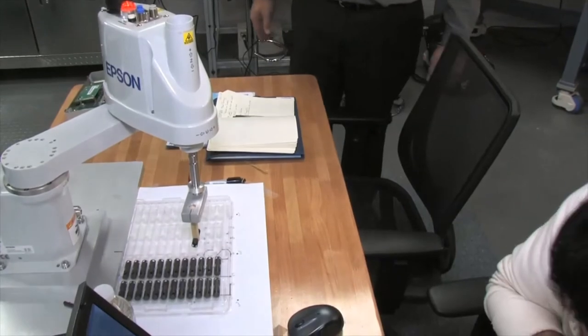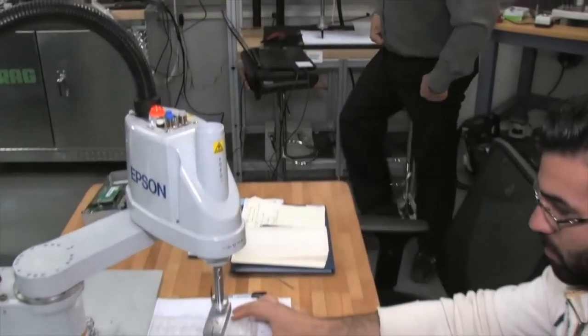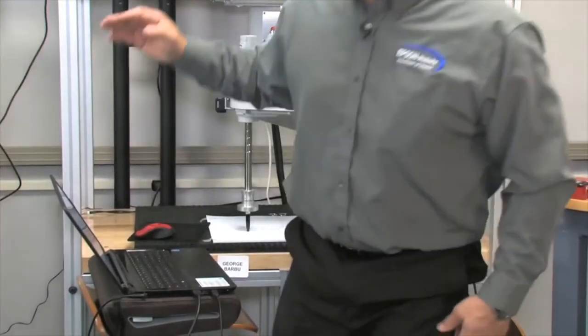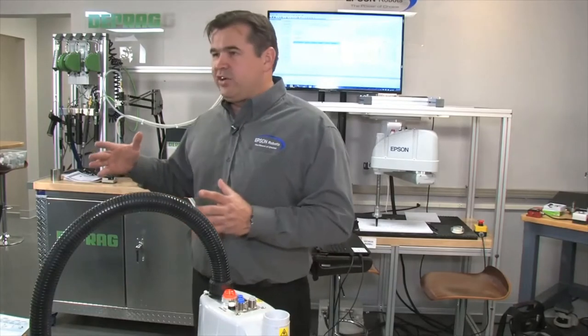All right, so what we're gonna do then in our code, we have our tool taught, but I just want you guys to see the tool. What I want you guys to be aware of though is in your tool, we have that offset. There's a maximum offset. If you're starting to go above 4 inches, and I have a 3 kilogram robot with 3 kilograms more than 4 inch offset, my robot's starting to have a lot of moment of inertia on it that could flip out my rotational U.